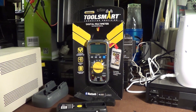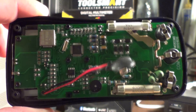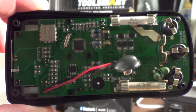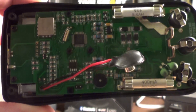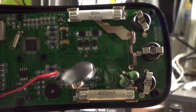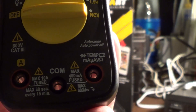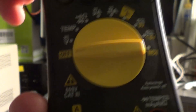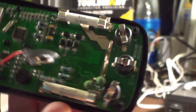What backs that up? Well, if we take a look at the internals of this multimeter, this is an inexpensive device, but the quality in terms of how it was put together is actually pretty good. The parts don't look like they were simply thrown at the circuit board and then a bucket of solder poured on them. The two protective fuses — both current ranges are fully protected — are of the ceramic type, rated for 600 volts DC. On the front it says 600 volts Category 3. I don't imagine it's truly a Category 3 instrument, but the fib factor seems a lot smaller than it usually is.